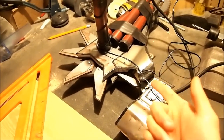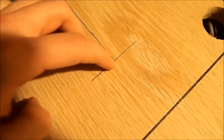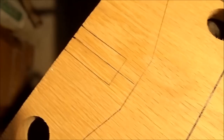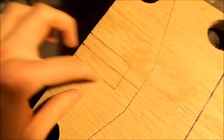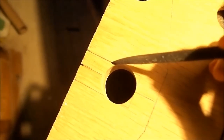I've got this three-quarter-inch oak board — the same one I used to cut the handle for my Krieg's buzz axe. This board is about nine inches wide. Make a mark two inches from each end and a mark at the center at four and a half inches. Make a three-inch line from that center point, turn it into a T with each arm going one inch, then draw lines from the ends of the T to the earlier marks. Draw a rectangle just under an inch and a quarter wide and two and a quarter inches long. Cut it out using a hole saw first, then finish with the jigsaw.